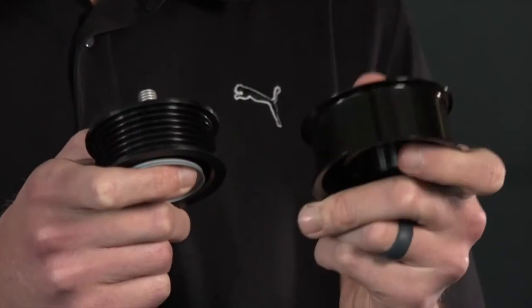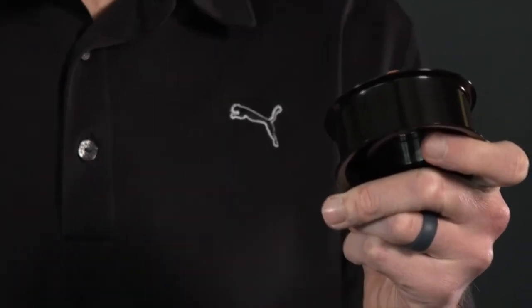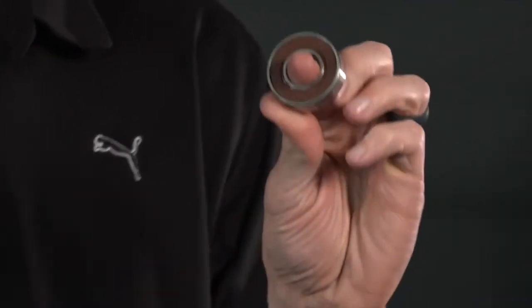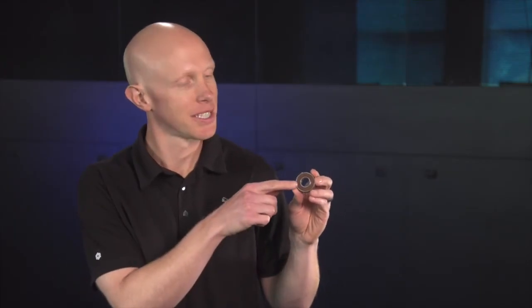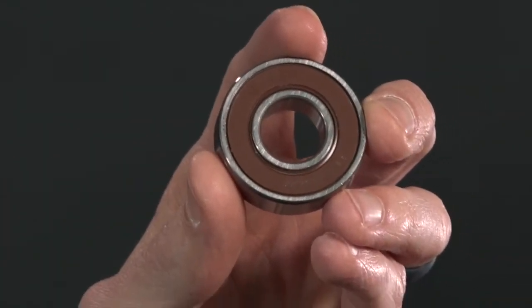Now, let's consider pulley design. They're plastic, steel, grooved, or flat. The important part is that they all have bearings inside. After years of service, these bearings lose grease and wear out. Heat can allow the grease inside the bearing to seep through the bearing seals. When you lose the bearing grease, it increases the operating temperature. When bearing temperature increases, you lose more grease. Soon after, you'll hear noise and the bearing will fail.